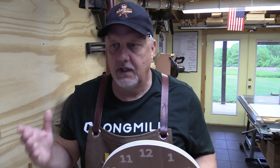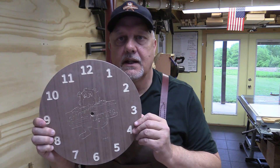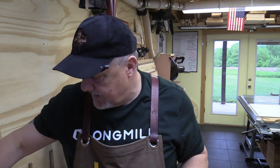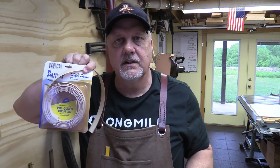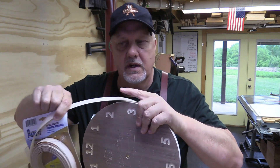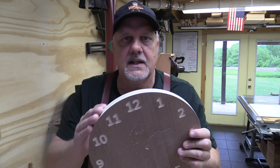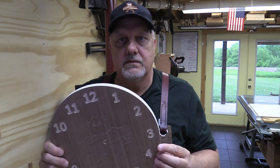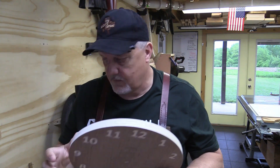The clock is all carved. I'm over at the mill — I use it as a kind of workbench, I do that a lot. The clock is carved, the holes are done. What I need to do now is use this real wood veneer. I'm going to glue or hot-iron this onto the edge of the three-quarter-inch board, and that's going to give me a nice clean edge — something I can poly or stain — but it will finish it off nicely.